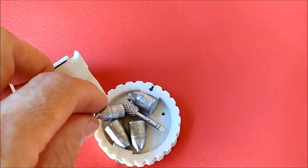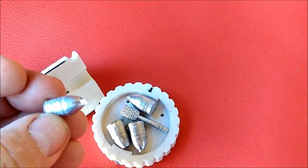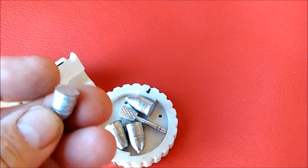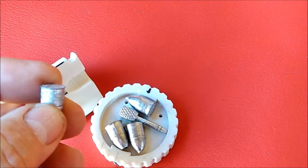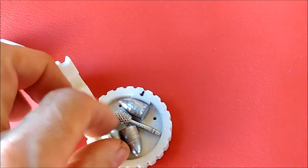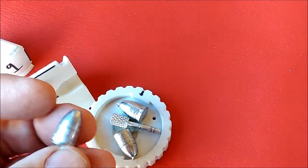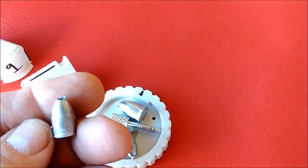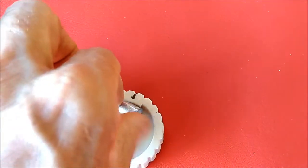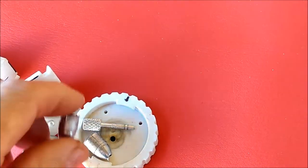However, this one had flashing on the nose of the hollow point because the hollow point pin was so loose that some lead was getting down in there. It started giving me good bullets but they were out of round. That's why this was just a guinea pig mold that I torture tested. This one I don't know what happened — it came out nice and shiny, but the bases and noses came out bad, so they were culled from the good bullets.